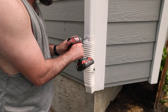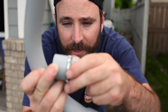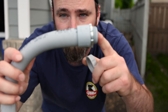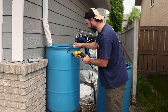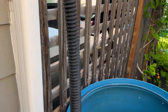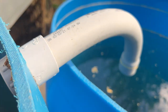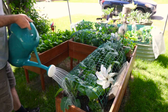The last step is adding the 90-degree PVC elbow. I'm using a unibit to drill the size of the fitting through the side of the 55-gallon rain barrel. The main thing is you don't want to over-drill the hole, so take it very slow. This allows the highest rain barrel, once full, to overflow into the second rain barrel. I sometimes silicone around the edges — kind of like your bathtub — just to make it more watertight. It might not be a work of art, but it works, and you'll be able to collect a ton of rainwater throughout your gardening season.